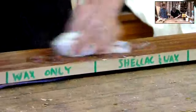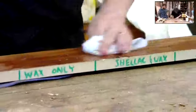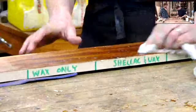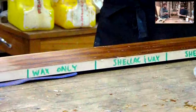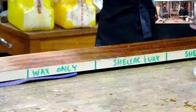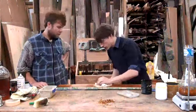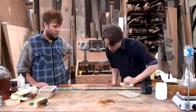So you would do this after you're finishing off all your shellacking, after however many coats you want to do. So the person who texted in earlier, Jennifer, after a clean, perhaps you could just put the final wax on. In some cases, depending on how patchy it is, you can just put a wax over it, and it might just solve the problem. Because it fills gaps, it still polishes as well. Yeah, it resaturates the whole surface. So that wax is in there.